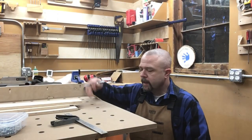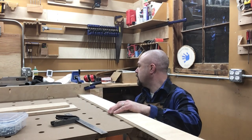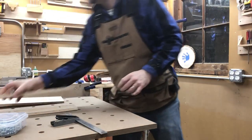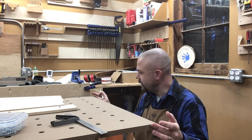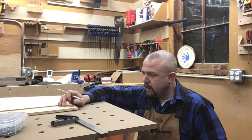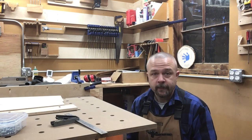I have my side pieces cut and drilled. Now it's time to scribe for the end pieces. I have two thicknesses stacked up here, clamped together, perfectly flush with the edge, clamped down to the table. I'm going to take one of these end bits, lay it on there, make sure everything is nice and flush and square, and then scribe a line underneath to cut to. I actually prefer scribing to measuring in something like this, just because the measurements can be off slightly. This way I know I've got it flush. What I'm going to do is get these cut, assemble the outer ring, then scribe everything else in the middle — lay the center long support down, get it scribed and cut, get it installed on the ends, and then figure out the length for the intermediate frames.